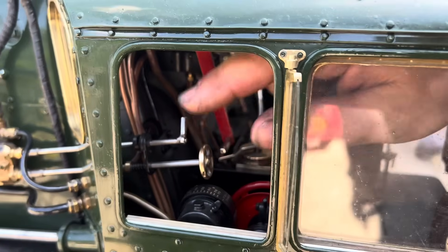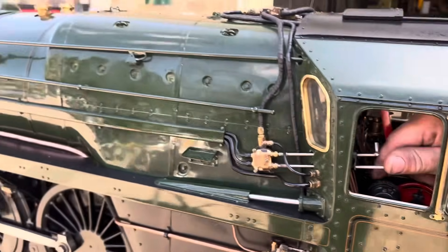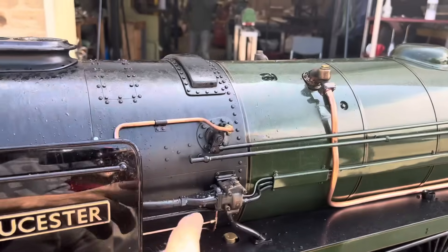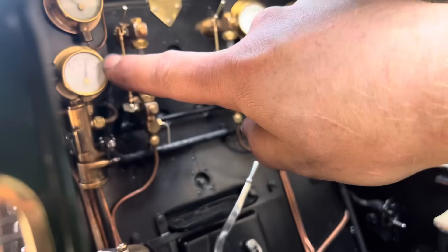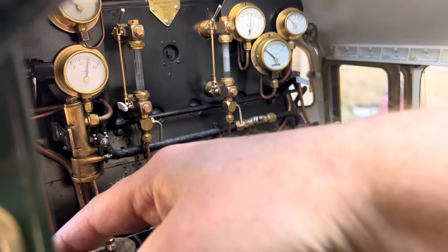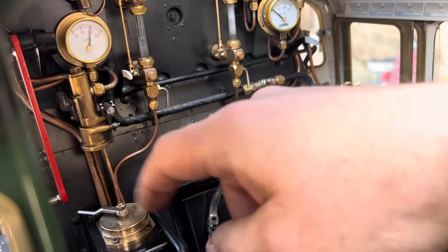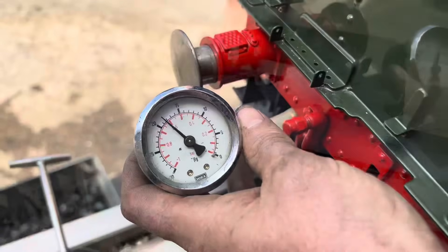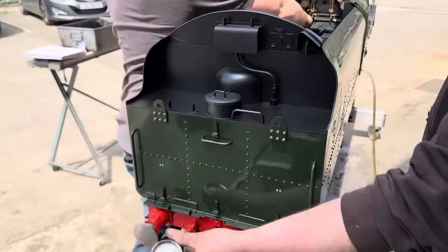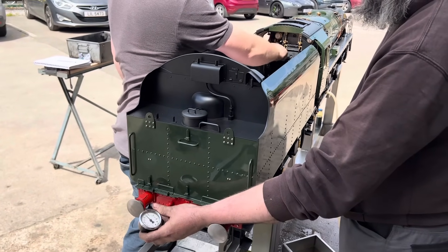On this side we have a small ejector and a large ejector which effectively blows a jet of steam through a venturi on the side of the smoke box and up the chimney — we've got a little leak on at the moment. It pulls a vacuum which registers on a gauge on the footplate, and when John operates the vacuum brake it goes to zero and the brakes come on on the tender and on the train. That's plumbed through the tender and you can see the same vacuum is translated to the back of the tender to go into the carriages — when John operates the brake it drops to zero and the springs pull the brakes on on the train.